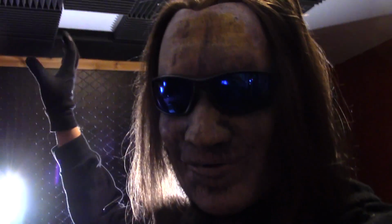I wanted a rectangle above my head, so that whenever I'm mixing, I'm sitting there in the chair, I don't have any of those reflections hitting me off the ceiling. And there's a science behind all that. If you look at professional recording studios, and you're able to see the ceiling above the mixer, producer, musician, engineer, whatever, you'll notice that there is a very similar setup, whether it be sound absorbers similar to this, or the wood sound diffusers. There will be something above their head, because as you're sitting down, you're playing music behind you, because the speakers are in front of you.